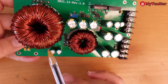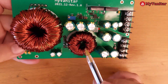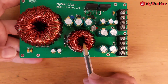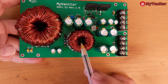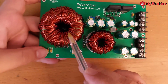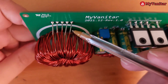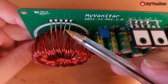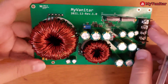I have calculated for these two inductors to handle up to 30 amps. This is the switching inductor and this is the output inductor which acts as an LC filter. For the main switching inductor, you can see I have used five 1mm wires in parallel to handle such a current.